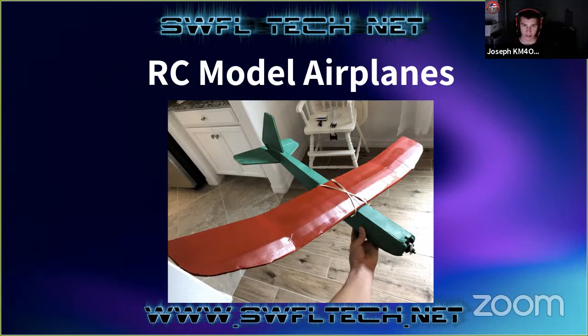And this plane operates on 2.4 gigs for the control link, which is fine because it's line of sight and you don't really want to fly it that much further. Though in this case, the control signal will last fine. But if you put a camera on there, then you're going to want to make sure that you have plenty of coverage. A lot of remote controls will give you a sort of beep or alarm to let you know you're running low on signal, which is good because a lot of the receivers that people use with these planes are goggles. So you can't really look down and see your signal level.